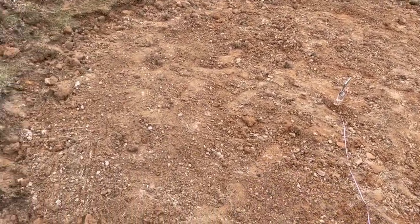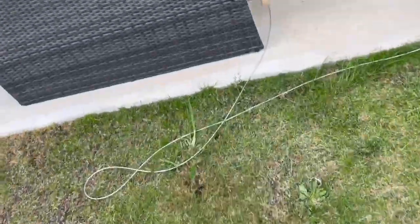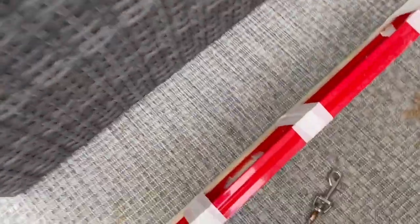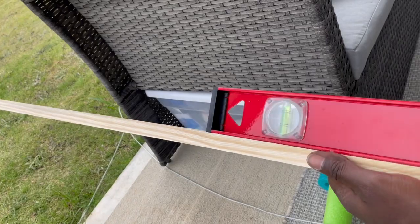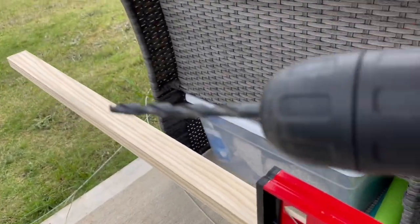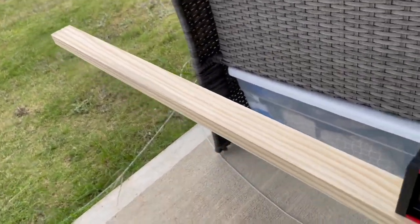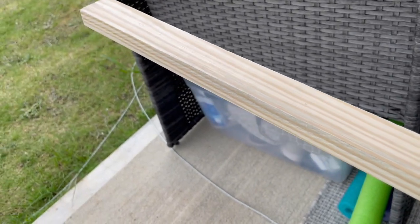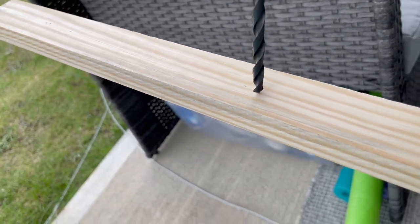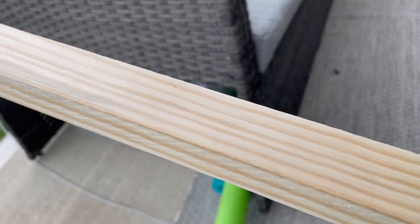It's going to get a whole lot smoother because next I'm about to level it with a leveler. I take my leveler onto my piece of board — this is an eight-foot, I guess it's a one-by-eight. I'm about to drill a hole into either end, and that's going to give me my seven-foot radius because the pool is 14 feet. This board is eight feet, so I'll come one foot in, drill a hole, and that hole sits on the center stake. I'll go around and either add dirt or take dirt away.